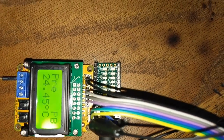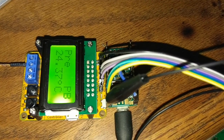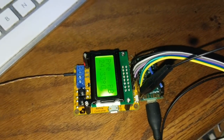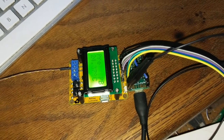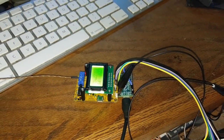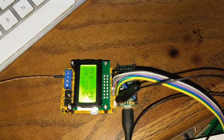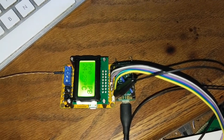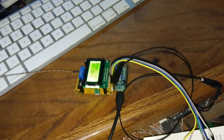This doesn't have a serial chip on it so I'm actually using a Teensy as a serial converter — most expensive way to do it, right. It's got TX, RX, VIN, ground, and DTR — maybe some kind of reset. There's also a reset button. This is a nice cheap controller, like $25-30, which is one of the cheapest setups you can get. It's open source, you can find the code on GitHub, and with the free pins broken out we might be able to do other things — maybe recode it to open a servo or something.